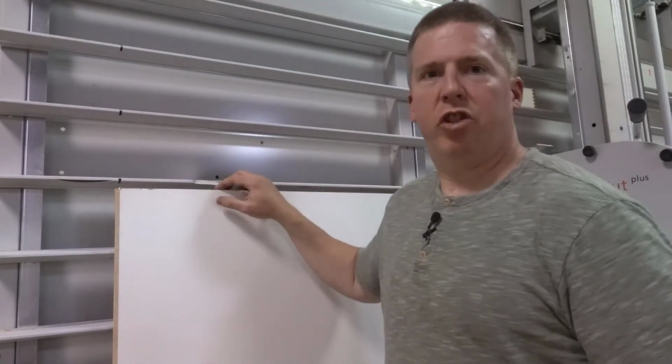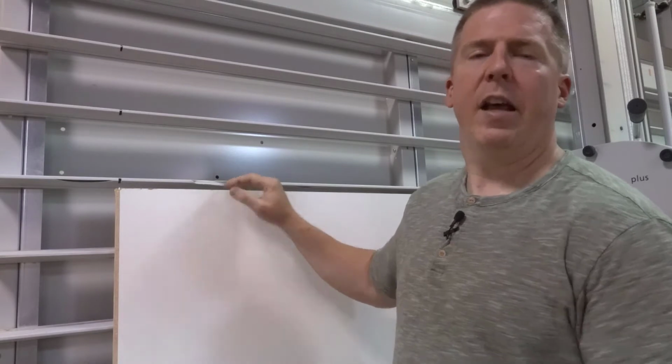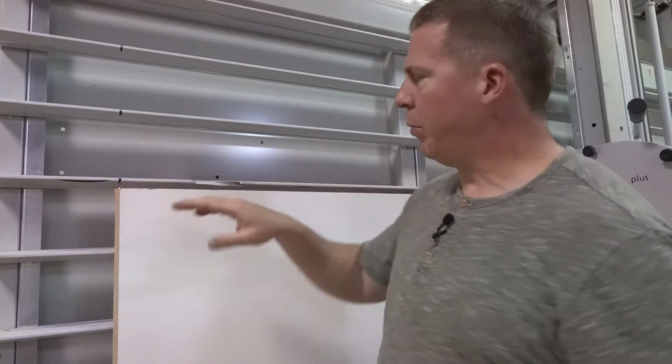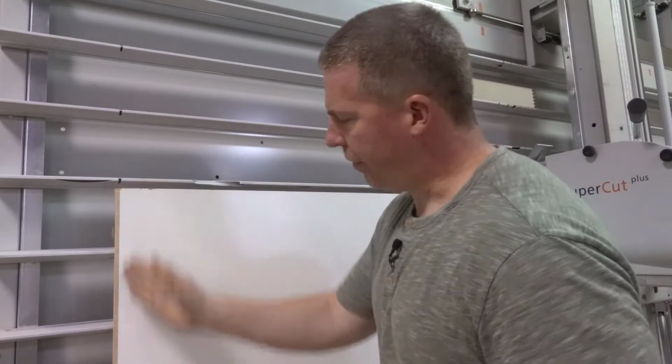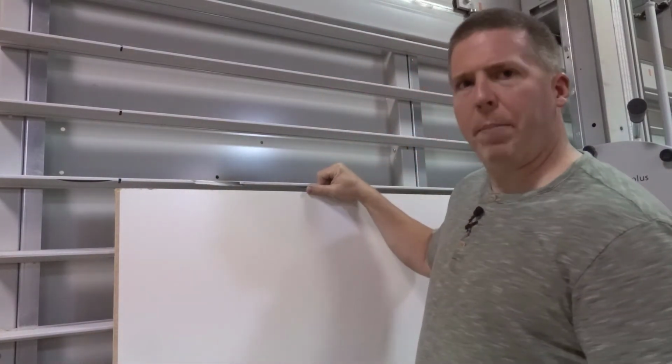Now that I've put the sheet onto the saw itself, onto the support foot on the base, I need to put it in a specific place, meaning I need to slide it into an area. What we need to do first is get rid of the factory edges. First this top edge, and we're also going to cut off the back edge right here, so we have a perfectly cut, nice and sharp edge for edge banding to go onto later on.